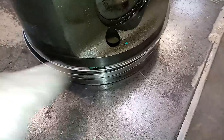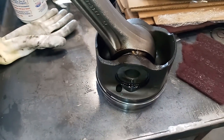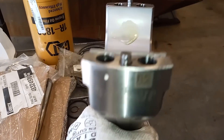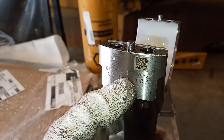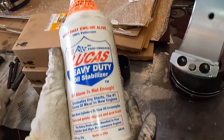So this is now cleaned, and you can see our piston ring gaps — it's supposed to be about 120 degrees apart from each other, or else you can get high blow-by initially. The piston's upside down so our oil control ring is on top. I always lubricate the wrist pin also while I have it like this. We have our new upper rod bearing installed. Tab is in the tab slot — some people think the tab holds it in, but it does not; it's for alignment. The bearing is actually larger than the journal it's going in, and the crush is what holds it in place. That is a factory-stamped number one, meaning this is cylinder number one.